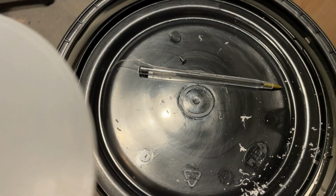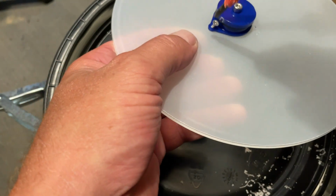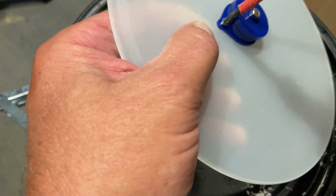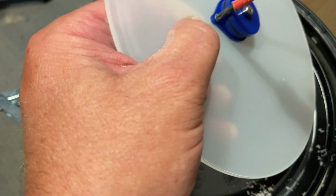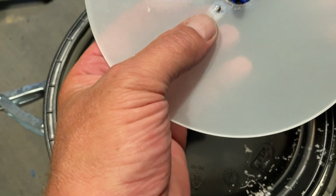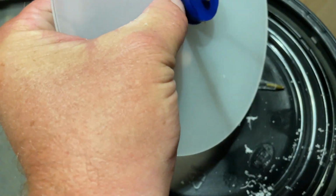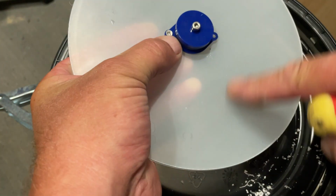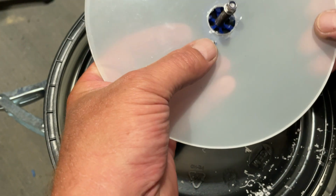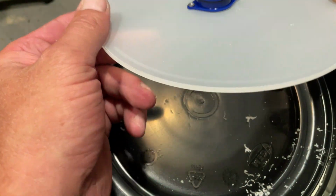I did have a screwdriver. So we're going to start to tighten up very slowly. Any resistance, you might need to drill the hole slightly bigger, or just pass the drill bit back through the hole again, just to open it up a little bit. And the reason for doing this is you can align it. You notice I've still got the protective film on it. Whilst I'm building it, I will leave that on just to minimize the scratching. It's not the be all and end all, but every little helps.